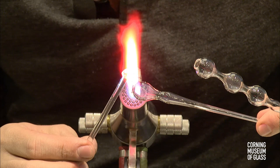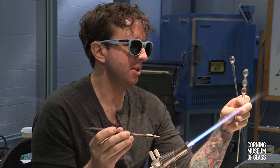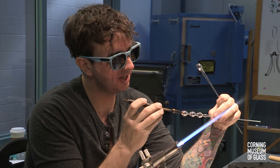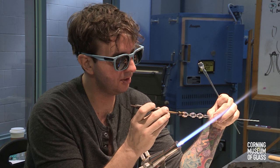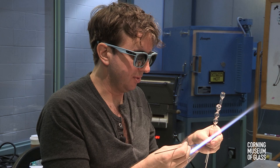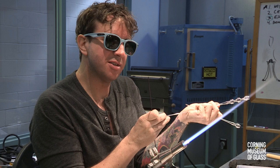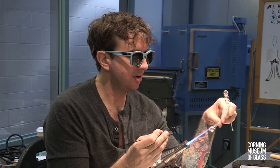And the interesting part about that, when I look back, is that the guys I worked with were all broke and couldn't afford tools, so I learned without tools. This is how they taught me: we'd take these welding electrodes that were graphite and file them into little itty-bitty reamers or little itty-bitty bowl pushers, and then we'd use glass as our tool for everything else. Back in the 90s, nobody was really making a ton of really nice flameworking tools, so it wasn't like we had them at our fingertips. At least we didn't know if we did. The internet was still just kicking off, so we couldn't go on a glass supply website and just find them. So anyway,